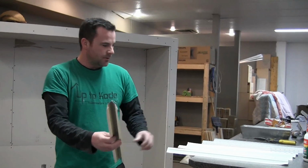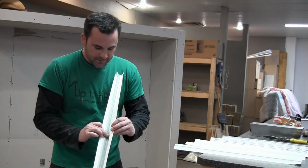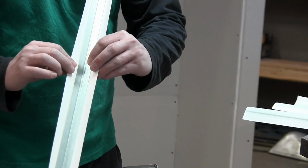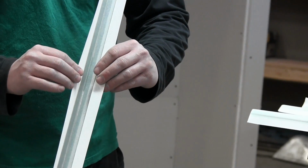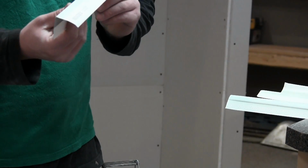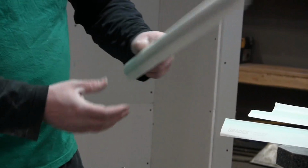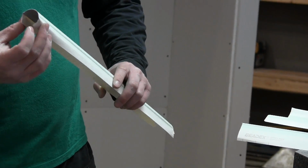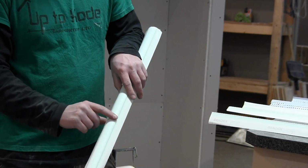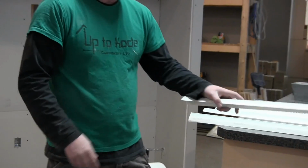Your two most typical ones are metal, to actually give it the strength, and then the paper over top to allow for application and for it to bond to the mud. This is for outside 90, so that's probably one of your most common, or the rounds. So the round ones come in different radiuses. This is the bigger radius. I think it's a 3/4, and they come with half, and there's all sorts of types of those.